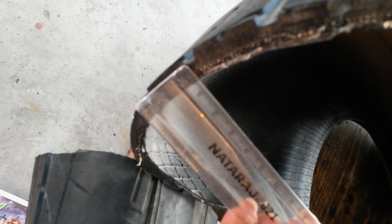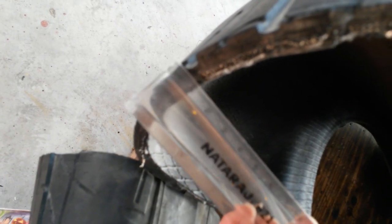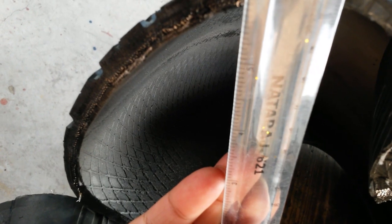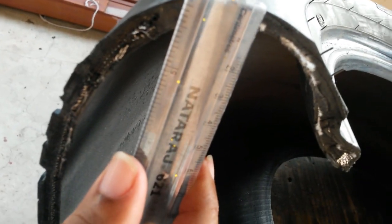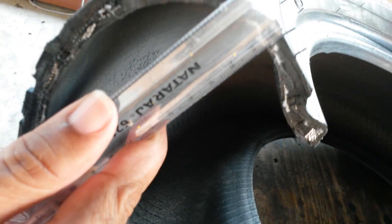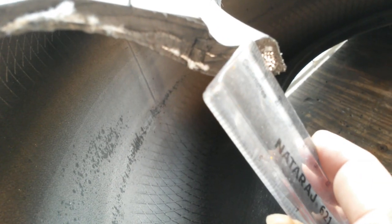Above that are shreds — the upper shreds aren't useful. About two to three millimeters, and that's the bottom of the tread. Overall thickness of this section is probably six millimeters. Here it's actually about eight millimeters thickness as it curves down. The sidewall thickness is six millimeters. Going down, the thinnest section I'm seeing is about five millimeters. This section here is about 12, here is 10, and the radial part is about 10.